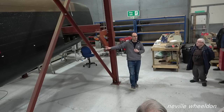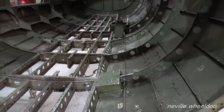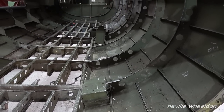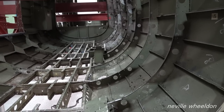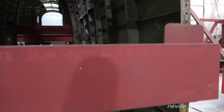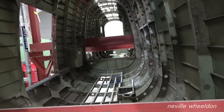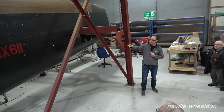The second problem is that NX611 has had a busy life and been modified and adapted over its service career. It also has quite a few problems on the lower formers inside the fuselage. If you take the opportunity to look down the centre of the fuselage, you'll see the formers on the inside are quite badly damaged — holes drilled in them where skins have been placed, bent and damaged. So a lot of those have got to be repaired or replaced.